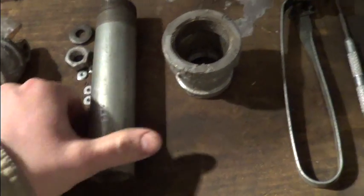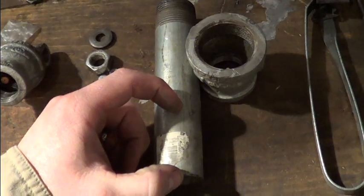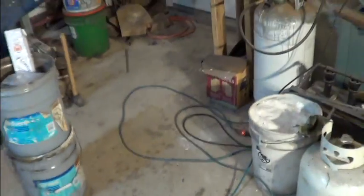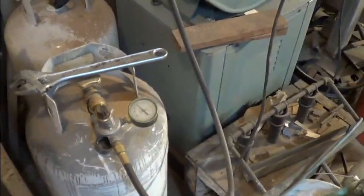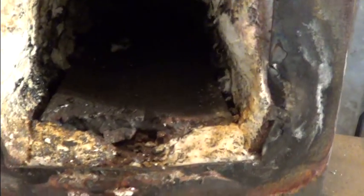This is about seven inches, I think it's seven inches. About two inches of this is going to be inside the forge. For lining your forge, the bottom is fire brick and the sides are kao wool. This is a bottom one from NC, but this is one I made — the extension.